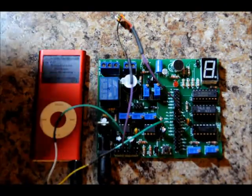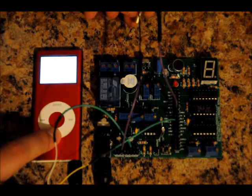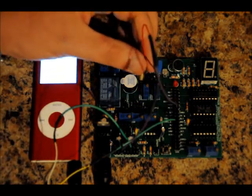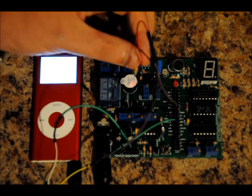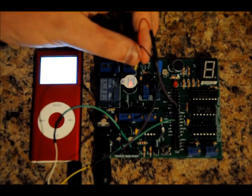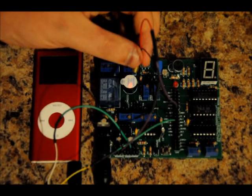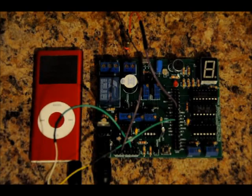I'm going to turn off the light and we're going to play some music. It might be difficult to see, but the laser beam is not steady — you can actually see it fluctuating. It's fluctuating because it's actually sending that audio signal along it. Now that we've proven that our transmitter is working, we're going to connect our receiver.